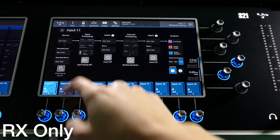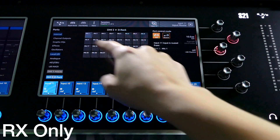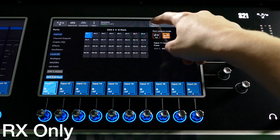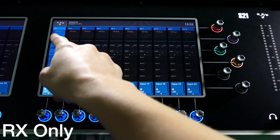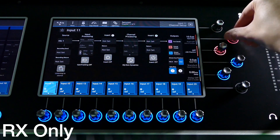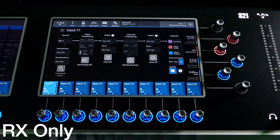On the second console, navigate to the same page and set the port control mode to receive. Notice how the colour of the gain on the channels routed from this rack have now turned orange and can no longer be changed. This is because we're in receive only mode, so can't send any control messages to the rack.